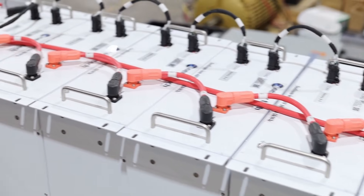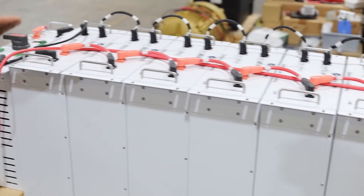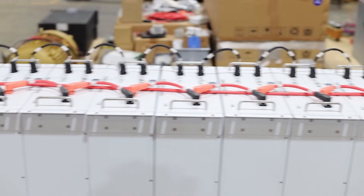The most significant point on these sodium batteries is that the depth of discharge exceeds anything else out there. On a lithium pack, you'll find that you have maybe 60% of the top capacity to work with — from 100% down to 40% is usable. Go below that and it'll give you trouble, reduce life expectancy, and you'll get the classic dendrite formation. If you want to buy a stack of batteries for the capacity of that battery — like this stack with 50 kilowatt hours — you get that whole range of use. That's the big selling point. Better days are coming for battery tech.